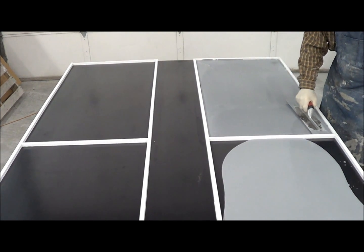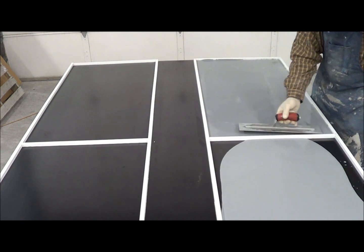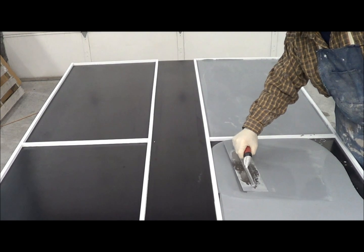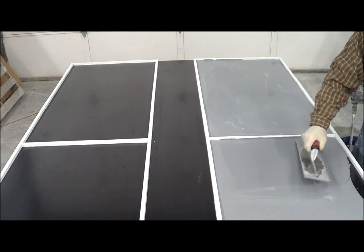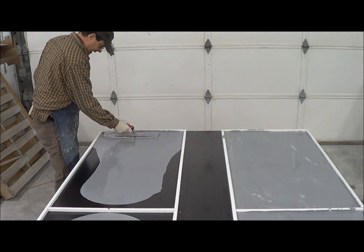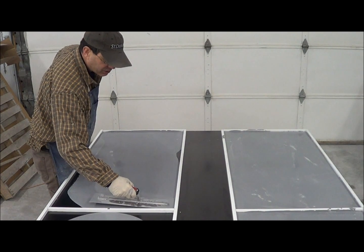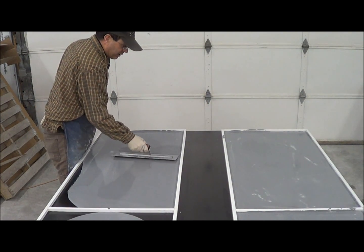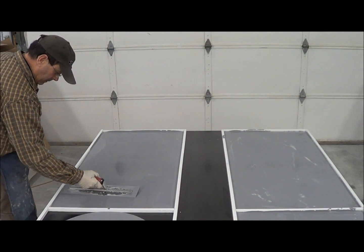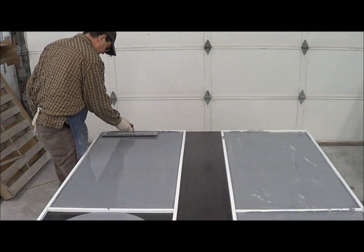The idea behind troweling is that you can get a thinner face coat. If you had to wait for it all to run, it would get a little bit thicker. You can squeeze a little bit where you need it and move it around. Now, the thickness with our AB mix doesn't really matter — the reinforcement is what matters. I could actually fill this up five-eighths of an inch thick with only face coat and we wouldn't have any cracking issues. No drying shrinkage cracks. What we might have is cracks because it's not reinforced. You've got large format tiles done quite easily.